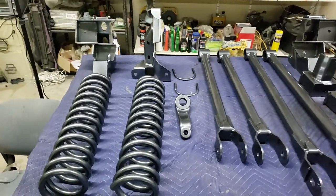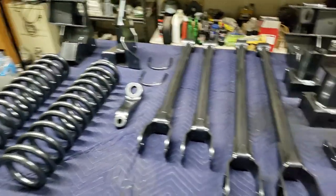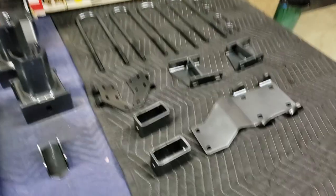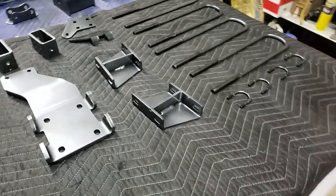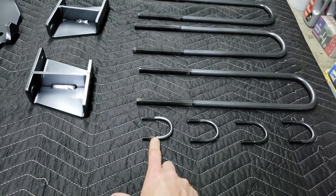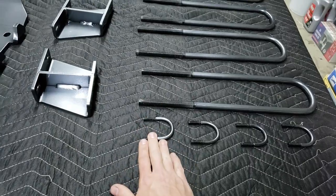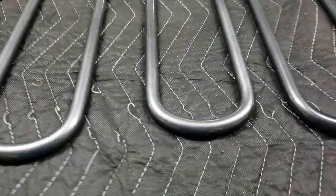Here is our final product. This BDS lift kit is completely done now. And I think the owner will be thrilled. We were able to save the threads here with the original coating, which should allow the nuts to go on nicely and provide corrosion protection versus bare metal. Had we powder coated it, it would have been too thick. So we didn't want to do that.